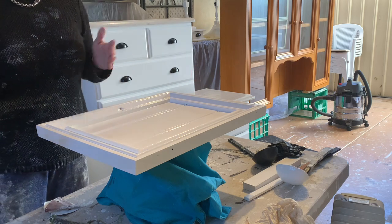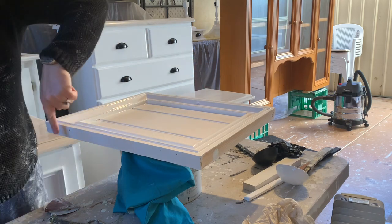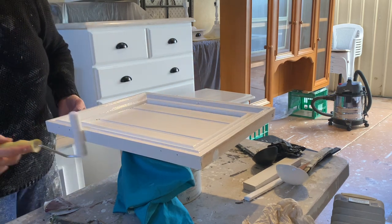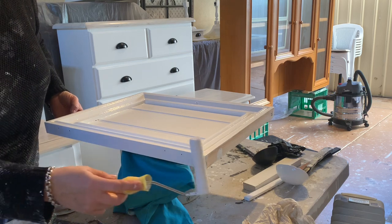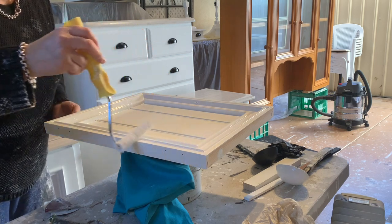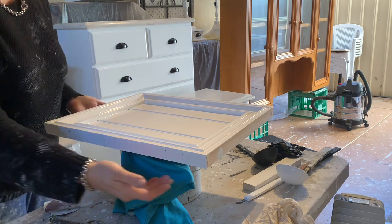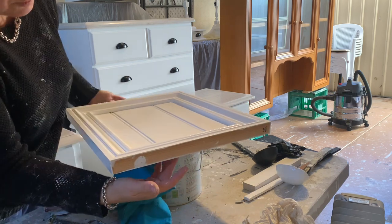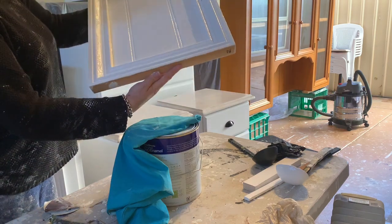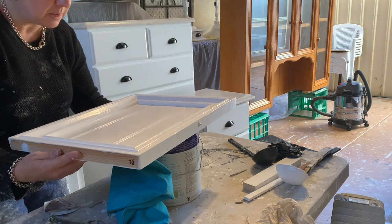You've got to be careful because if you put too much paint on you're not going to get the door back in the same way — it's not going to shut. You've just added millimetres to each side, say a mill each side, and you've only got a tiny little gap. So what I do is where I paint I go in with a sander and take as much as I can off — all the varnish or paint or whatever's on there — right back to raw wood. Therefore I've still got enough millimetre to get the cabinet in.